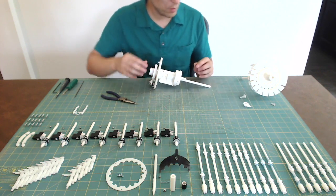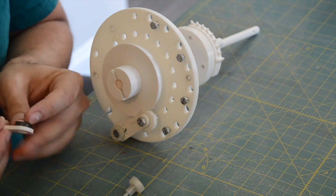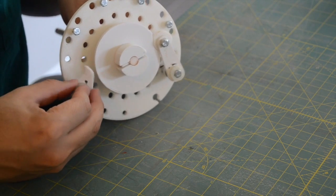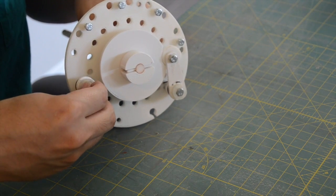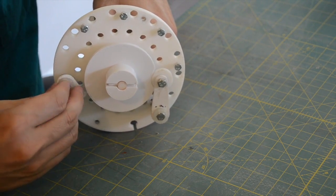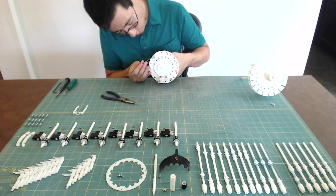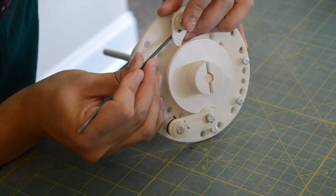To attach the anti-reversal lever, put an M5 bolt through the sheath to make it a shoulder bolt. Slide the shoulder bolt through the anti-reversal lever and place the anti-reversal lever spring over the anti-reversal lever. The spring's second leg should be pushed into place so that the spring provides tension against the toothed portion of the zero positioning disc.